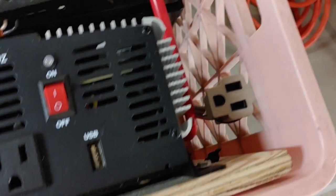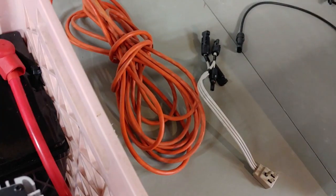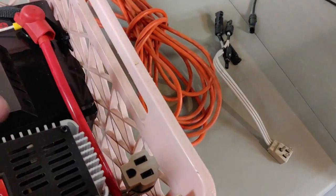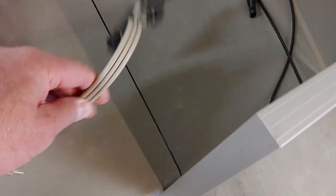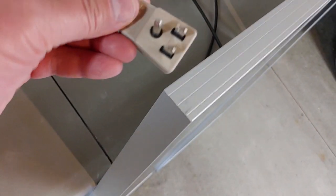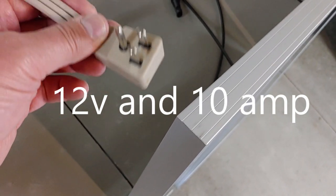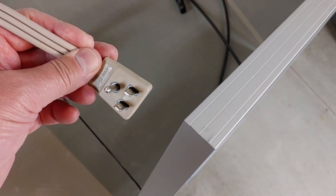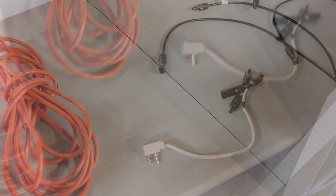It's actually pretty simple — just plug and play. The reason I put the female end at the extension cord end is for safety. If someone plugged something into it, nothing would happen — it's only connected to the solar panel. If I had put the male end there, someone might have inadvertently plugged it into a wall outlet, sending shore power into the charge controller and blowing it up. This way that's impossible. Yes, when plugged into the solar panels these terminals are live, but they're only 12 volt DC — very unlikely to get a shock, like touching car battery terminals.